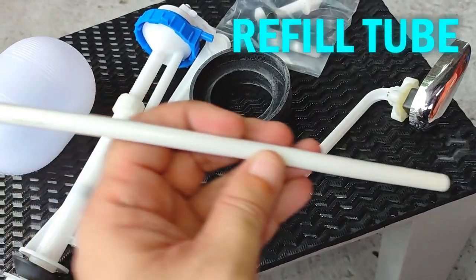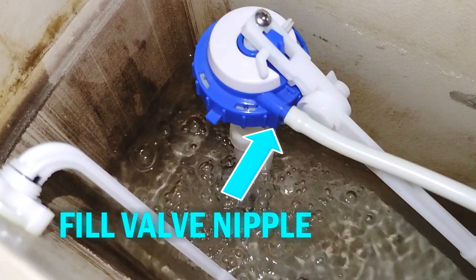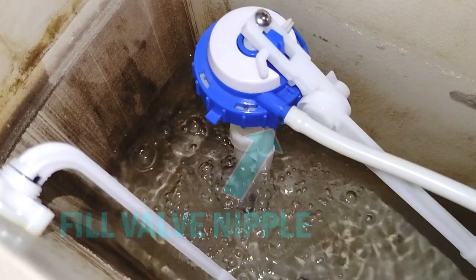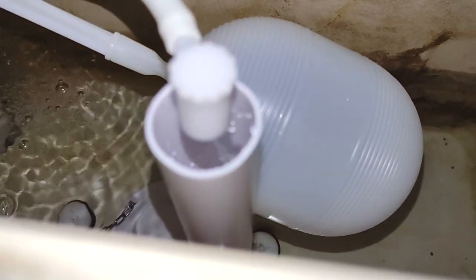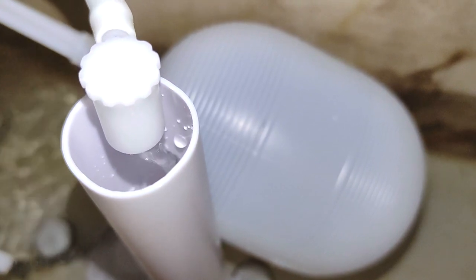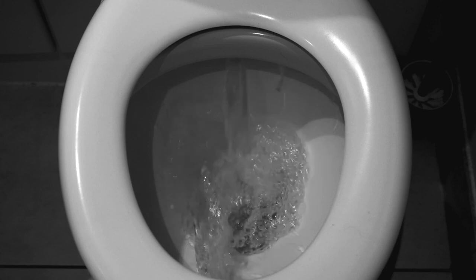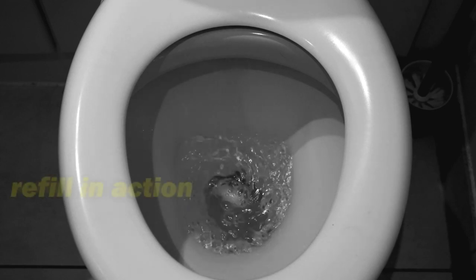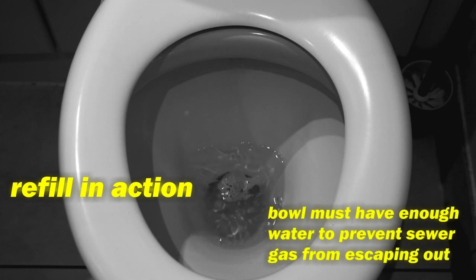Finally, we have this refill tube, arguably the most misunderstood rubber or plastic hose of a toilet tank system. One end is attached to a nipple on the side of the fill valve while the other end is attached to the brim of the overflow tube with a clip or angle adapter. While the fill valve aggressively replenishes water in the tank after a flush, it also refills the bowl with some water through this tube. During a flush, the siphoning action through the trap sometimes pulls more water out of the bowl than is necessary to maintain a water seal. The water in the bowl is responsible for blocking sewer gases in the drain line from reaching the room. If the bowl were left with insufficient water or empty after a flush, the room would likely get very stinky.